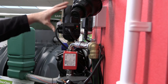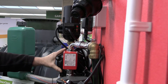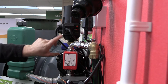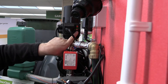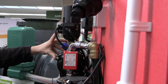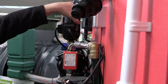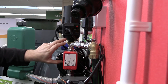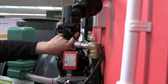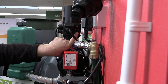If we create a demand by flushing a toilet or opening a tap, the pressure will drop on the Control-Matic and it will send power to the pump. Now if there's a problem with the pump — if it can't draw water out of the tank or there's an issue with the pump itself — the Control-Matic will notice the pump hasn't started to run, and you'll see a red failure light. There's no pressure on the gauge. There's a red reset button at the top — it's always worth trying that. You'll see it causes it to send power to the pump again, and this time the pump runs okay, so we've got an amber light showing we're sending power to the pump.